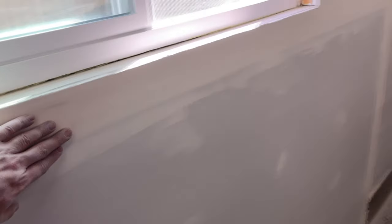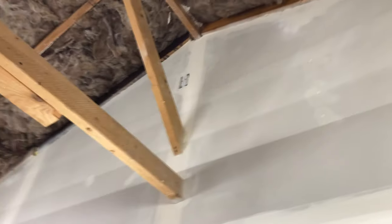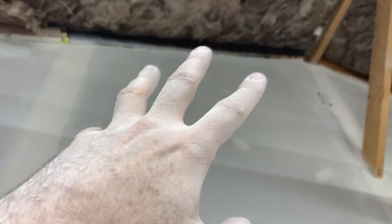All my walls are nice and silky smooth - that's as good as they're going to get before the next coat. While I was up there sanding, I noticed something interesting I need to address before I go any further. As you can see, we have rafters here. This end rafter - I actually installed these so I have a place to nail my tongue and groove knotty pine ceiling to once I get to the edge, because that didn't exist before. It was in behind this drywall, so I had to add an additional one to give it something to hold on to.